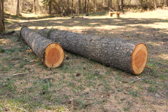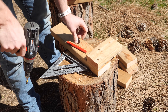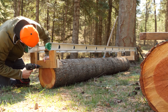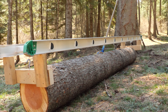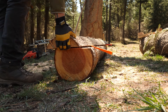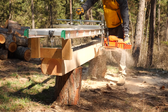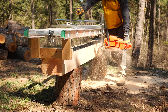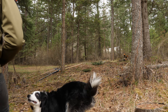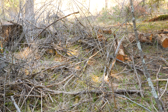First off we'll need to make a couple of posts for this drop. This is my first time making dimensional lumber with the mill instead of just planks, so instead of throwing the ladder on top of the raw material, I made a crude jig to control where we place our cuts. The setup worked super well, but it still took a few hours to cut two nine-foot posts — virtually free lumber, but not the most efficient means of obtaining it.